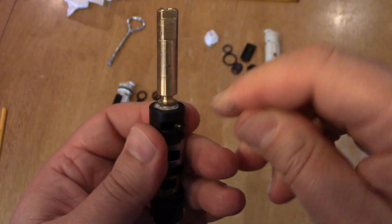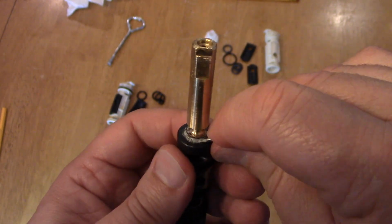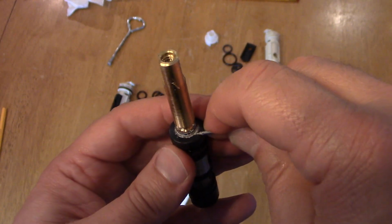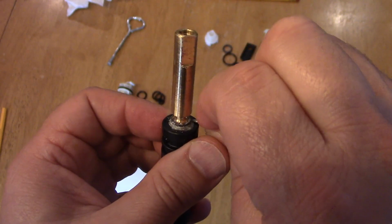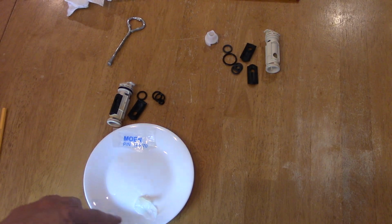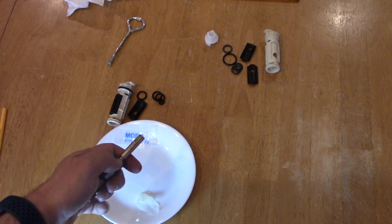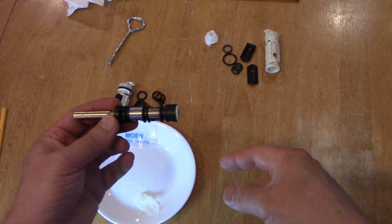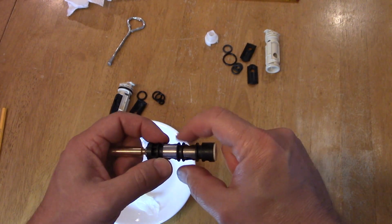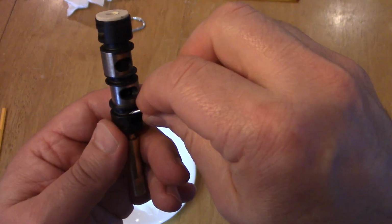It's kind of like a plaque, and that's because the copper is a little corroded, or brass, whatever you want to call it. It's a little bit more corroded from just all the things in the water. I have well water with a lot of minerals. There's a little corrosion there. So yeah, just break it down and then use the Scotch-Brite again to clean it up. And then in a plate I put some petroleum jelly here, and then I used the Moen lubricant, and I just sprayed it in here for later so I can work without getting it dirty. Then what you would want to do is start getting the O-rings on the middle O-rings and then work out. So these two O-rings are what we will put in first and then go to the outer. But again, I'm just making sure all these grooves are clean in here.